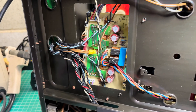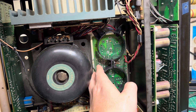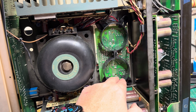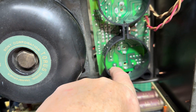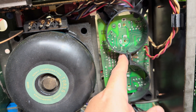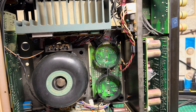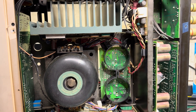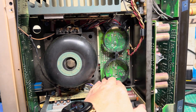I've installed the frame, but the design solution is strange — the board is held only by screws to the capacitors, and the capacitors just sit on these pins. We also have to screw it in between the capacitors because the board is connected with wires. I don't want to remove the transformer, so I have to think how to work around that. The whole assembly feels quite flimsy.